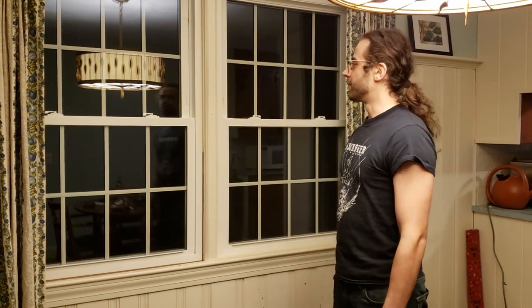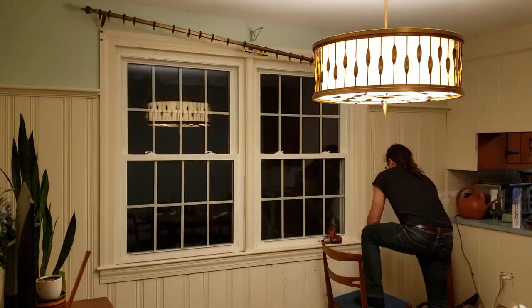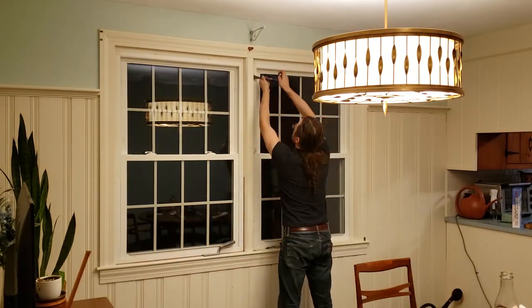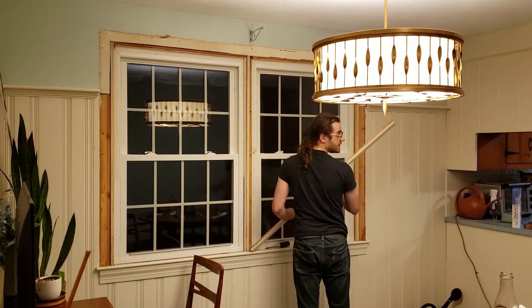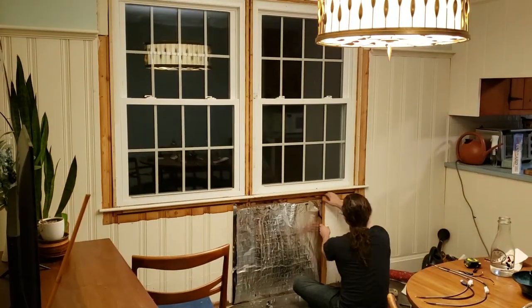In my case, I have the fortune of having a double wide window which is very similarly framed to a door frame. The night before, I removed all the trim and paneling to make my job the next day easier and shorter. I got that job done in this extra radical montage style. Here I'm just removing the curtain rod and then using a spackle knife and a small crowbar, I'm removing all the trim and framing around the window. I made an attempt to save as much of it as I can without breaking, with the assumption that I might need to reuse it later.